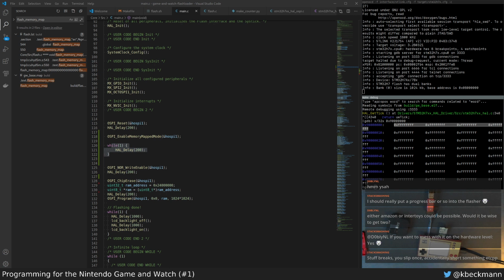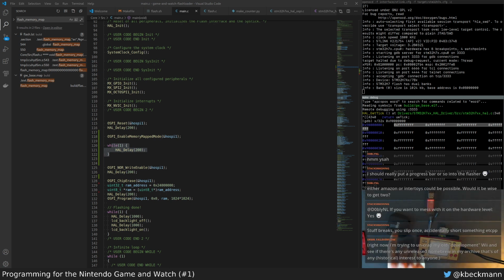So I'm using a Saleae Logic, or however you pronounce it, and it has an insanely bright LED, so I had to tape it. Some fancy probes. And yeah, let's set this up. So since we're operating in a single SPI mode and not quad SPI mode, I'm just gonna connect the 4 pins. All right. I guess the easiest way to do this is to connect the clips first and then turn it around.